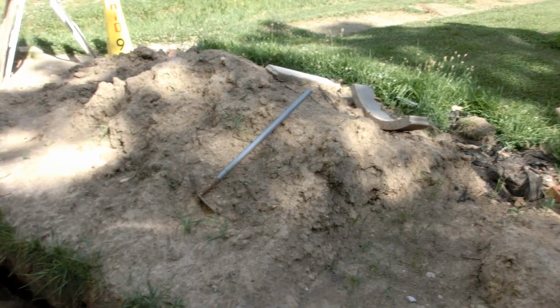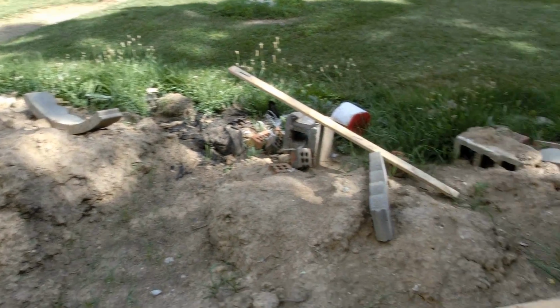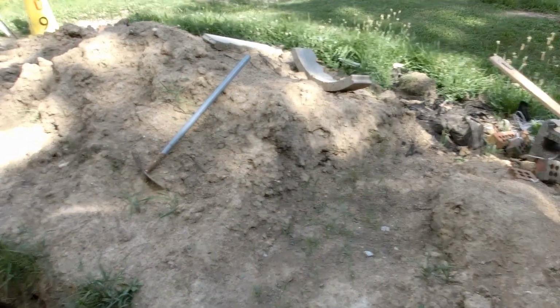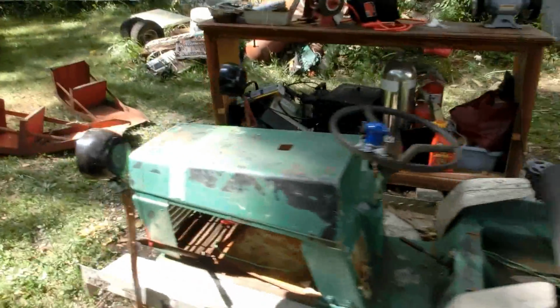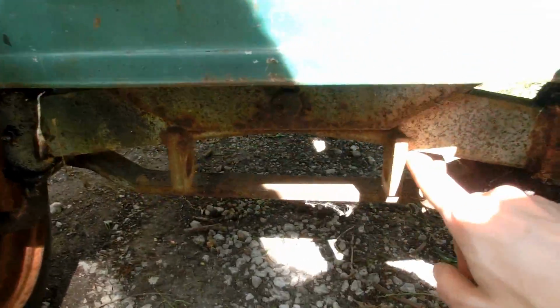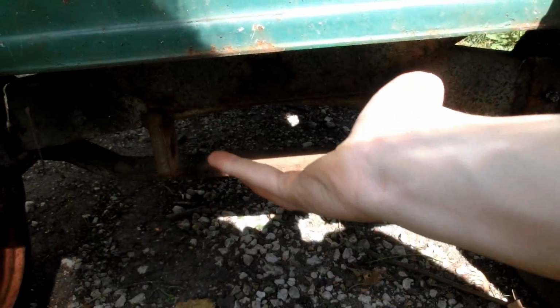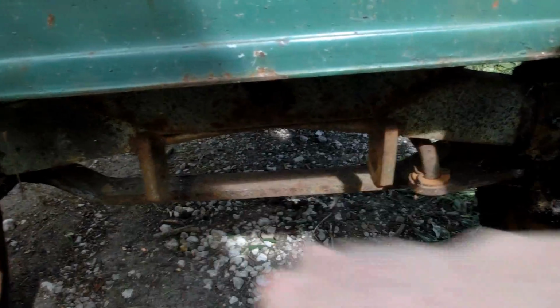So I think what I'm going to do is spend today trying to build a mechanized way to move it. I'm going to try to upgrade my electric lawn tractor to have a front on it that can push dirt, like a bucket lift or something. It shouldn't be too difficult because we have some nice mounting places in the front where we can hook stuff. Like right here, there's two holes that originally, something you probably could put like a snowplow in there already. We just put two rings on there and put a pin through, and that should be good.